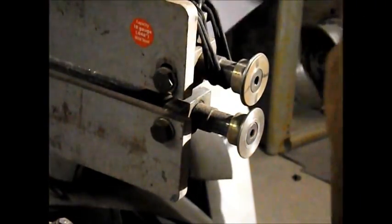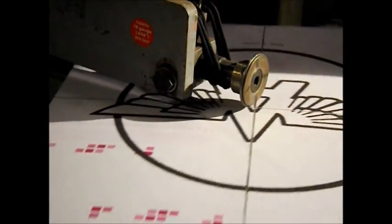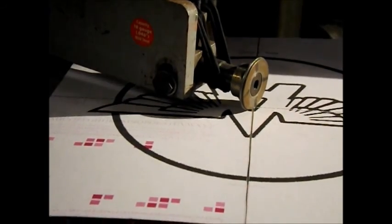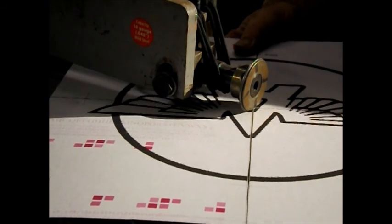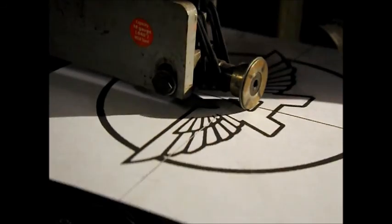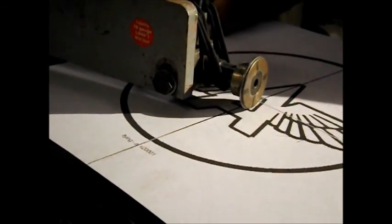So we're going to just start by working from the inside of the panel out. And what I'd like to do is pick my first location on the metal, touch, and then I load into the sheet. And we start driving here. We unload. Now, when we have corners that have a larger radius, we can go a little bit further, and then we can actually turn on the radius.